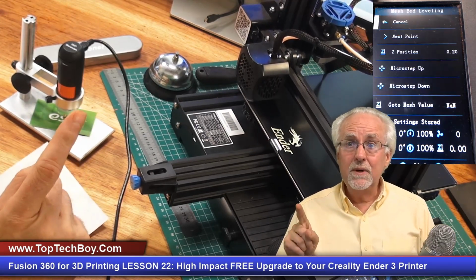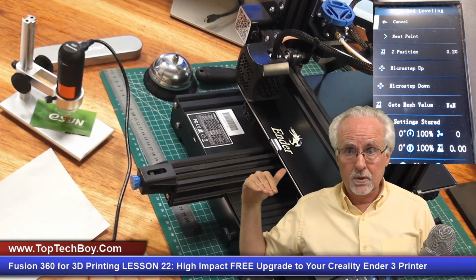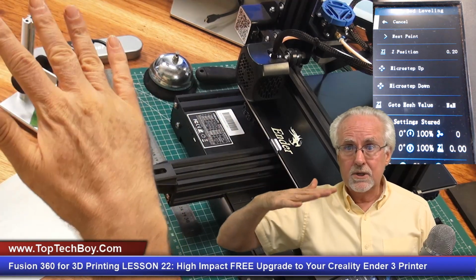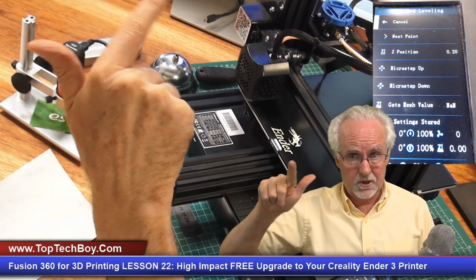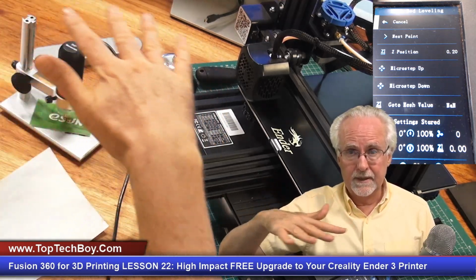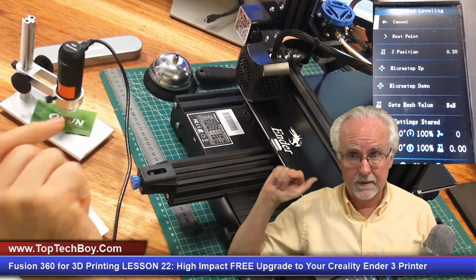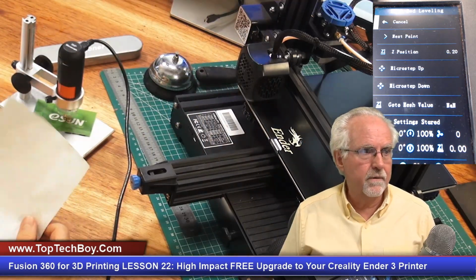Okay, now I will say I do like to level the bed using manual leveling like I just did before I create the mesh, because I want to start with the bed absolutely as level as I can. So you saw me do that. I leveled it using the settings under manual level. Okay, I did that. But now I'm going to compensate for the curvature.